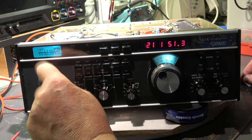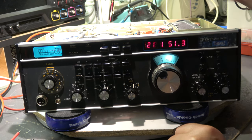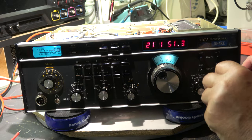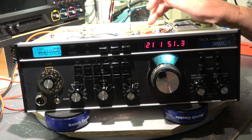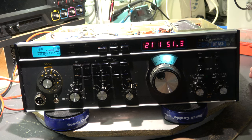This could be a bad contact. This contact also affects the synthesizer, so maybe we have a bad contact in the switches — that can be cleaned. But in general we now have full reception, and the reason was only a badly inserted noise blanker board.